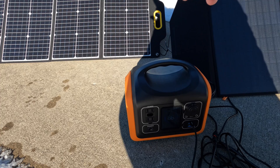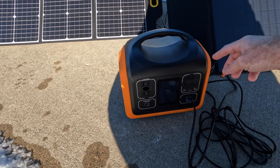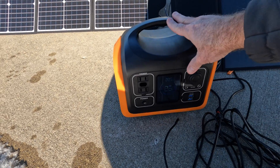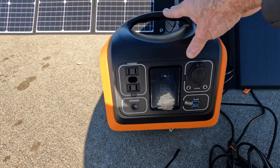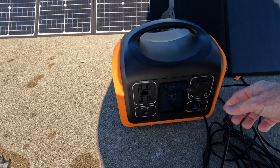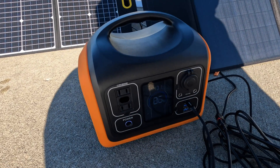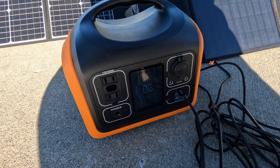Now I've got a Powerness panel coming through the side, maxing out at whatever it can. Without the Type-C connected, I'm getting about 81 to 85 watts from that panel. Now plugging in the second Flex Solar panel — even blocking part of it with my shadow — I'm getting 135 to 137 watts. That actually worked. You can fast-charge your power station if it has a PD power input.